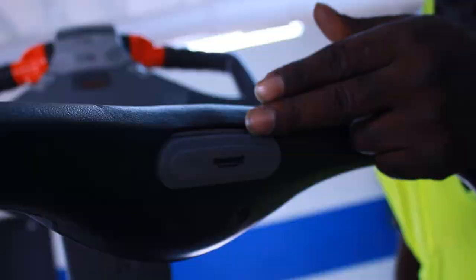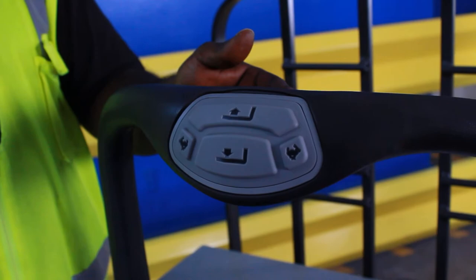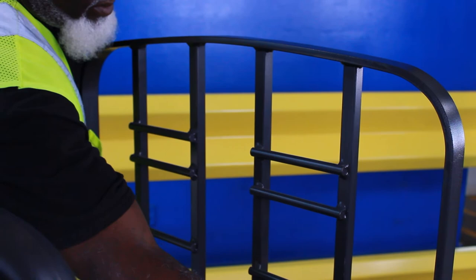It also has a rapid control that will allow you to go just a little bit faster, but I don't recommend the use of this because the equipment is already set at a speed for the warehouse where it's at. This is your load backrest — this stabilizes your load as you're transporting it. Your forks are used to pick up your load so it can be transported.